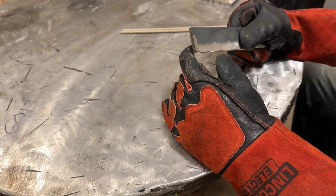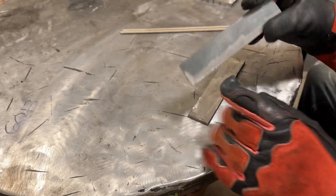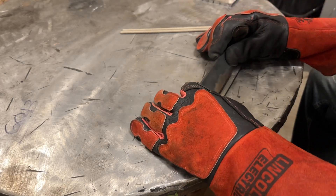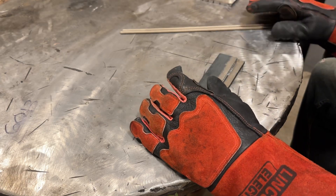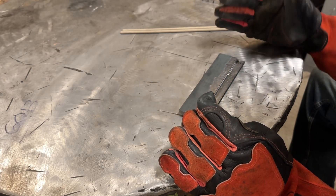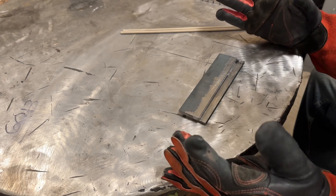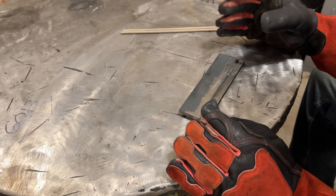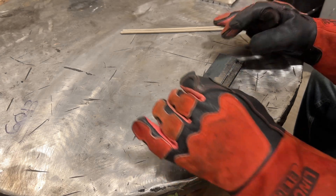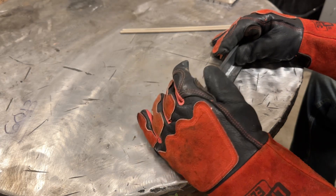Our setup is pretty much the same as it was in the shootout video — prepped plates. I didn't grind up here because I'm not going to be welding up there. I bumped the amperage up from about 115-120 amps and I'm going to run this rod at 130, which is above what I ran the 7018 pass at, in the hopes to see if the results are different or the same. Proof's in the pudding. I'm going to tack this up, weld it, cut it in half, and etch it.